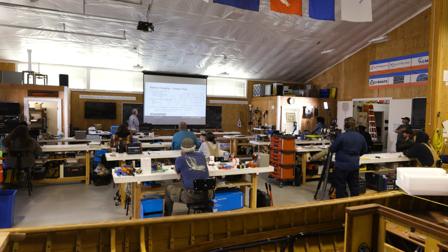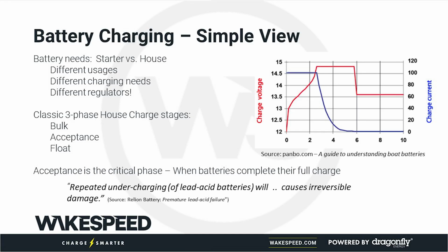Here's the deal. Classic battery charge curve. You raise the voltage up. It'll come to a certain voltage point potential, and then you hold constant current, or sorry, constant voltage, and the current, the acceptance current of the battery drops. Doesn't matter the technology. I know early on, they say, well, these batteries need this, these batteries need that. In the end, all batteries run this way. If you go and talk to manufacturers, this is what battery manufacturers will document as their preferred charging methods.